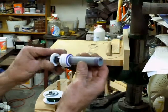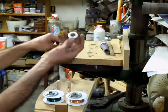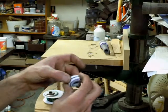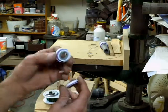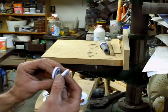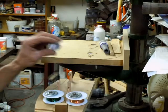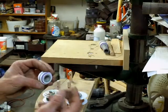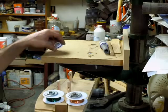It's a great temporary holder to help you assemble it. I also wanted to mention about making these rings — I cut these out on my table saw, but I have a real sharp blade and tight gaps in the fence. These things can end up kicking back in your face real easy, so it's kind of delicate. I will make another video just showing how I made these if you want. You've got to be real careful using the table saw. You could use a band saw, which would be much safer — no kickback.